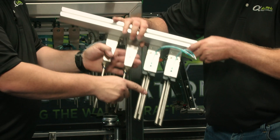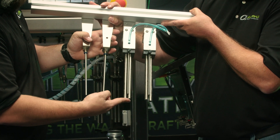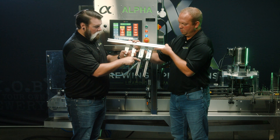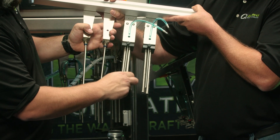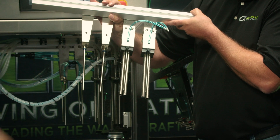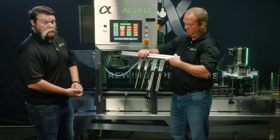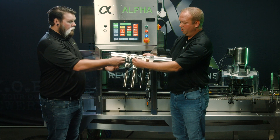The final adjustment is on the back side of your fill head — the height of the fill purge tube in relationship to the bottom of your fill tubes. You want roughly a quarter inch to a half inch — basically as low as you can get. To adjust, loosen the set screw, set it, and tighten down. There are also thumb screws for convenient, tool-less adjustments for speed and efficiency.